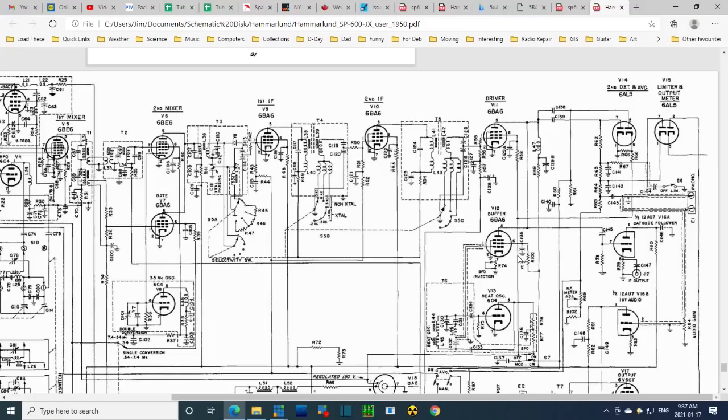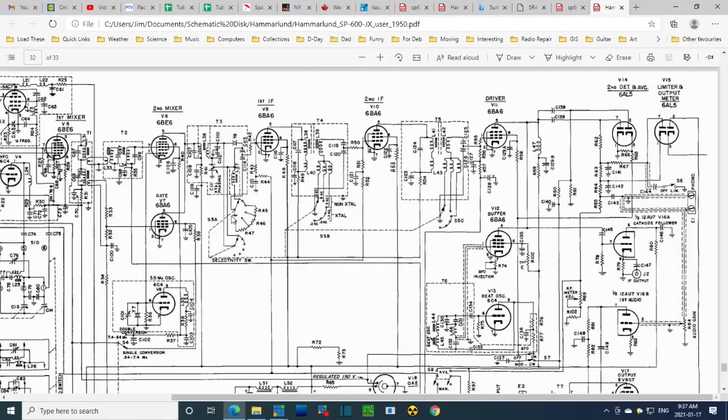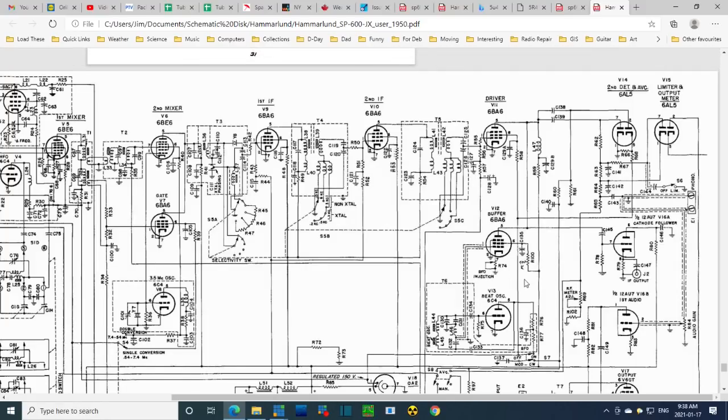this is where the resistor was popped off. The resistor was popped off of which terminal? I'm just looking in the back of the radio. Okay, so it's terminal 6. Resistor popped off terminal 6. So if we go here, we see 6. This resistor, it popped off right here. Well, that's a weird note. What's that? I don't know what that is. R100. So this guy popped off. He soldered back on. Screen's back in place.